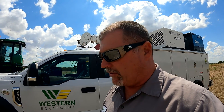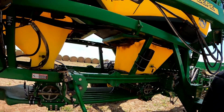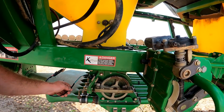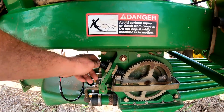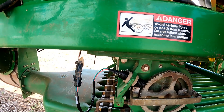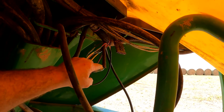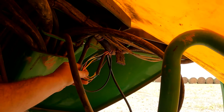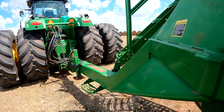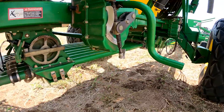One of the problems we've got going on here with this 1910 cart is that we're not reading a seed rate up on the display. The customer's already swapped out the front and the rear speed sensors and still can't get a rate up on the display. They've also done a little bit of a wiring job, rewiring the CAN and the communication wiring up to the cab because there was a problem at the front of the cart.